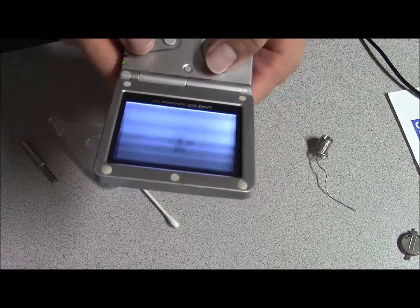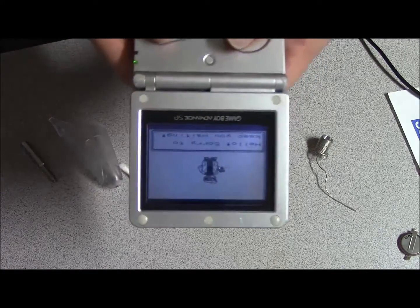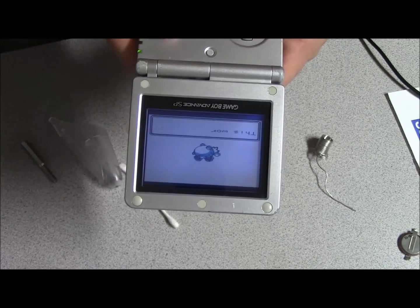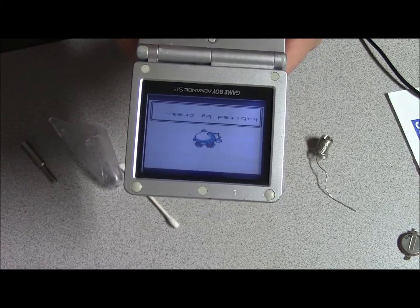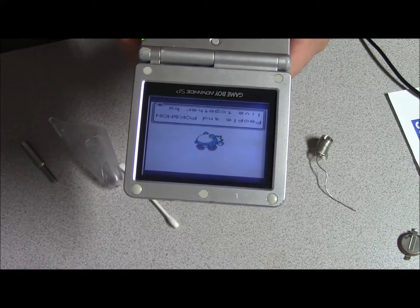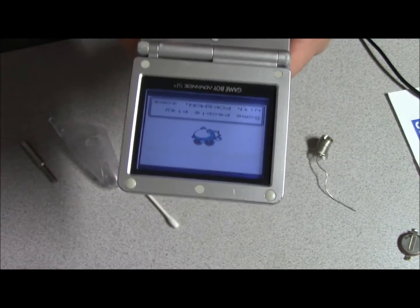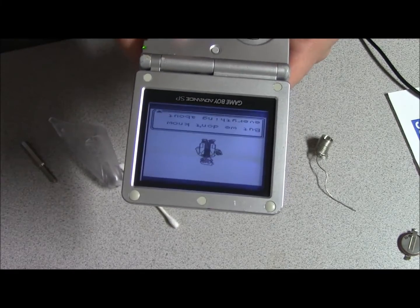What I said before, when you guys are using the soldering iron, be really, really careful not to burn yourself. Also, when you put a little bit of pressure on the battery, when you get the contacts heated and the solder becomes liquefied, don't put too much pressure, because I learned this the hard way. You can flick the hot solder toward yourself and burn a couple of holes in my shirt.